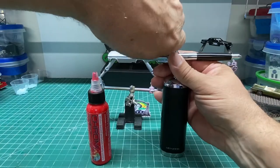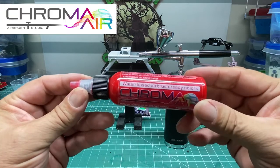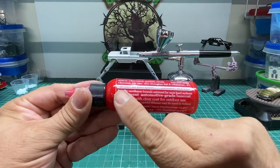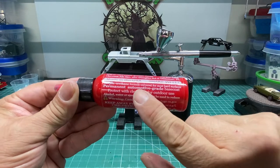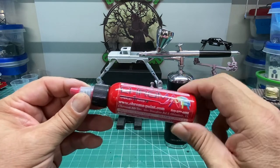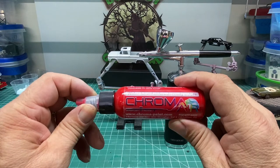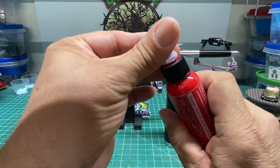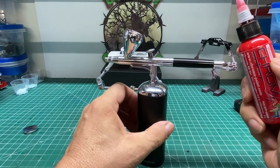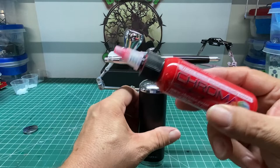Here we've got the airbrush all set up. We're going to remove the cap cover, and I've got some paint from Spray Gunner called Chroma Air — this is their in-house brand. What's really cool about this paint is it's a water-based, airbrush-ready acrylic urethane formula for most hard surfaces. When you're finished painting it, you're going to have to clear coat it to protect it. It's a really good product and they've got all kinds of colors with new stuff coming out. Check out Chroma Air from Spray Gunner. Now this brush has a 0.3 needle. When spraying water-based paints they recommend a 0.5, but you can use these paints with a 0.3 needle — you may just have to thin it down a little bit.